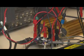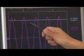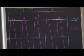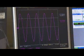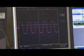Hi, I'm about to demonstrate the power limit feature of speaker guard. I have a TPA3110 EVM set up here, driving a 1 kHz signal into an 8-ohm load after the measurement low-pass filter. In this oscilloscope screen, the white line is P-limit and the purple line is the audio output, which is roughly 10 watts. The P-limit pin sets maximum output voltage, which is roughly 4 times the voltage on the P-limit pin. As we decrease the voltage of P-limit, we see that the maximum output voltage decreases too, and the output starts to clip. In this case, the maximum output power is limited to 3 watts.